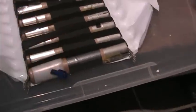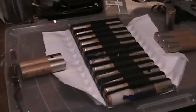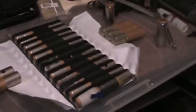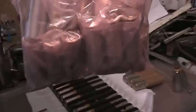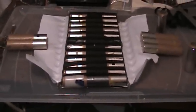These connections were supposedly troublesome. I didn't really find any loose connections, but I think the biggest problem is people don't plug their batteries in every week like you have to, and you end up with a half-dead battery. Just trying to salvage the cells can take an incredible amount of time. I pulled and tested two batteries worth and got maybe 40% that were still good. You need a sophisticated battery tester — a Vencon or Cadex hooked up to a computer — to even consider it.